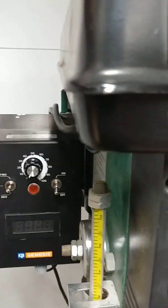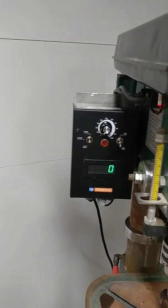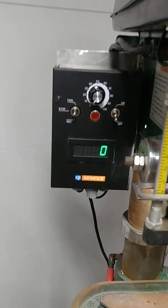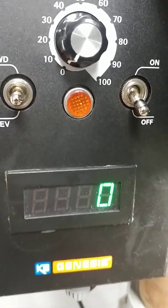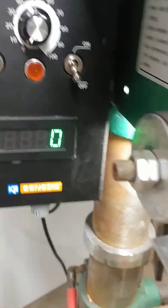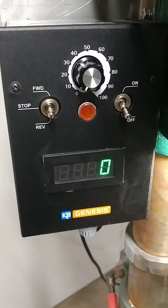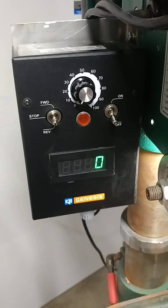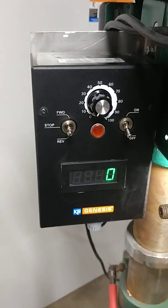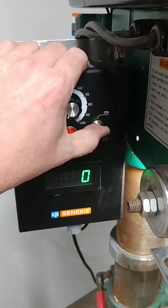When the magnet comes in contact with the sensor, that's what triggers the tach. To start this up, just power that up and you can see our tachometer turns on. I used a 110V relay output inside to power just a simple little 9-volt AC-to-DC adapter — basically a phone charger or anything that puts out at least around 8 volts and 200 milliamps would be sufficient.